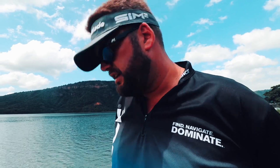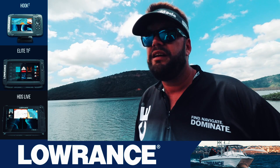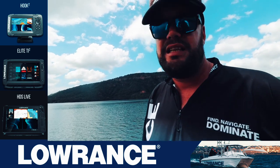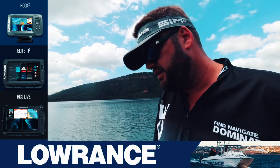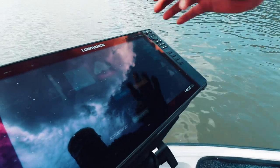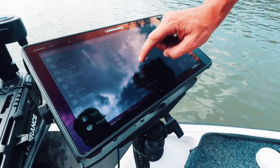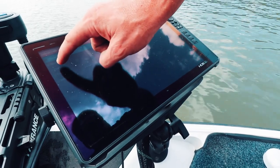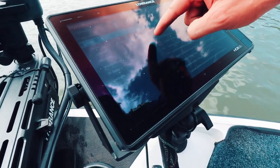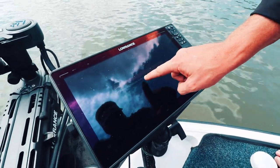Right guys, John from Lowrance. We're out here in Inanda Dam to test the Ghost 360. For the guys that have not installed the new software, you need to update the HDS Live and you need to update the Ghost. So we've done that now, so let's see what we have. Okay, so we don't have any 360 features, so I'll go to settings, advanced, features, and you'll see there's a 360. We're just going to switch it on and now we'll have a page. It says Ghost 360 features enabled.